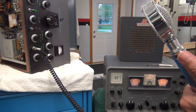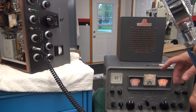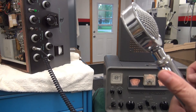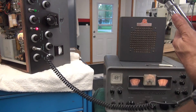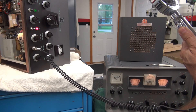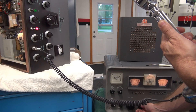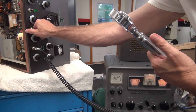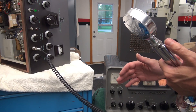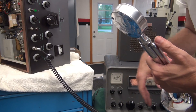Now we're going to check the quality of the audio coming off of the Viking 2. We've got a Hammerland 180 receiver with just a little jumper wire for an antenna. The transmitter's into a dummy load. Obviously the audio does not sound too good coming off the Viking 2 — she's pretty broken up. So we obviously have some other issues with the modulation. The current's good, but I suspect maybe a bad preamp tube or some open resistors in the audio section. So back to the Viking 2 we go.